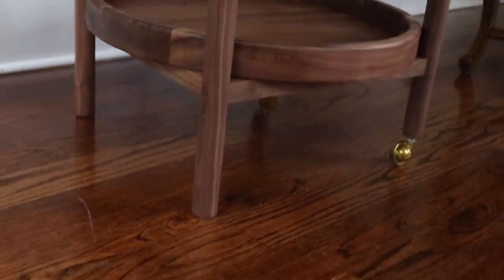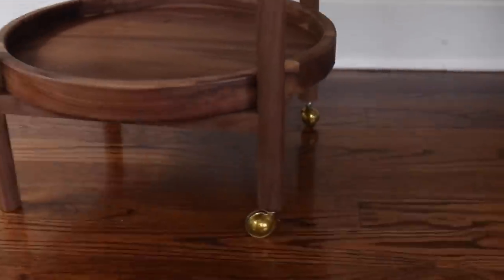So now let's talk about all the problems I encountered on this build. You all saw that router table incident - let's see what it looks like with finish on it. I don't think anyone is ever going to notice that, and I'm super happy with how that patch turned out. I also accidentally cut off the bottom of this leg, and I glued it back together with a dowel, and no one will ever know. Over here under this tray, you might notice something a little odd - I drilled some holes in the wrong location, I ended up plugging them up, and we don't ever have to talk about that again. Lastly, the handle. I really wish I was able to make those miters work out. I think maybe I want to try it again - starting off with square stock, cutting the miters, then turning those pieces into round dowels. I think that would solve the problem.